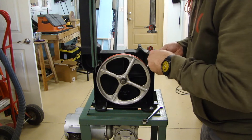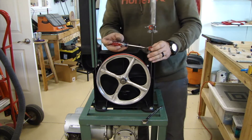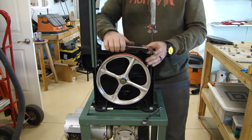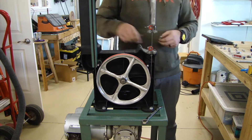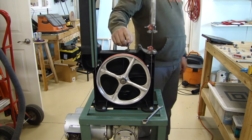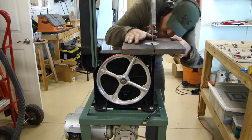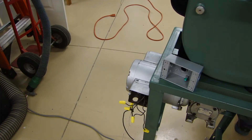You can see I'm kind of bouncing between about 90 and 92 meters per minute. So just did a little bit of math — 91 meters per minute is 298 to 299 feet per minute, which from some searching on the internet looks like a pretty good range for cutting steel, which is my intention here.